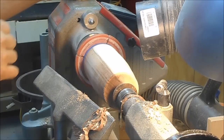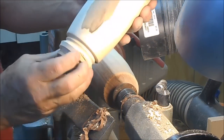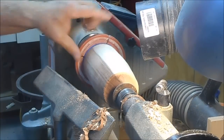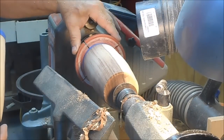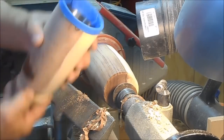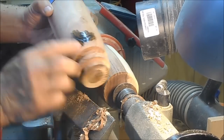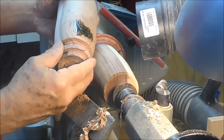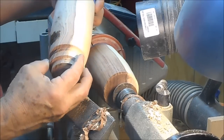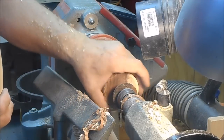Alright, welcome back. I got a little ahead of myself. I've been reshaping the blanks, as you see, and reverse chucking them into this Nova soft chuck that you can turn. So I've turned this to match up with the inside diameter and expand it so it'll hold it. And obviously here I had a little crack I was filling with some black epoxy to blend in on this hickory. So this one has already been turned, but anyway, you know what I'm doing.